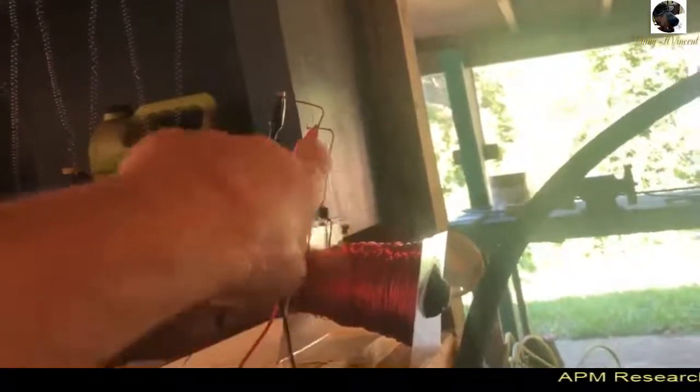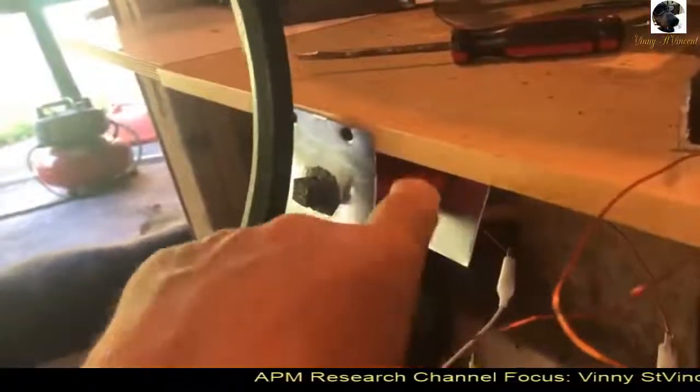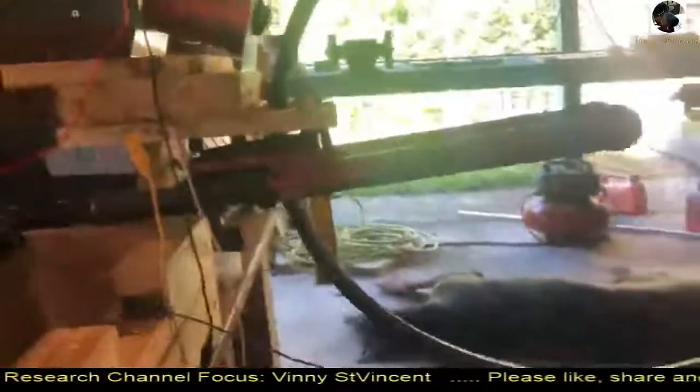All right. Well, 12-volt battery: coming out of the positive of the 12-volt battery, going into the start of the primary wire on this. This is a bifilar. Primary wire is 16 gauge magnet wire. Going in there with the positive, coming out the other end, and going to this coil, which has the same setup as the primary, a bifilar. We go into the start of that one, and out of that one we come back and hit a reed switch, which is the switching device. We come back out of that and go right to the negative side of the battery. So there's your loop right there.